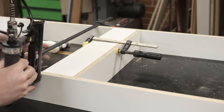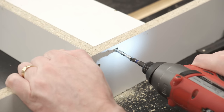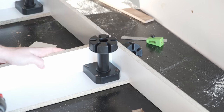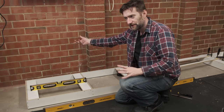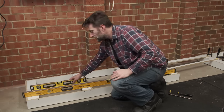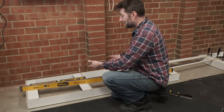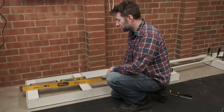The assembly process is pretty similar to the cabinets themselves - tack it together with nails, then screw together. There's the outside box, and on the inside these L pieces are made up of two stretchers to provide strength and rigidity. These L pieces also provide a space for the feet to attach to. These plastic cabinet feet provide plenty of weight bearing and adjustability for leveling - they're also pretty cheap. Leveling the cabinets is where the plinths really shine. Rather than having four feet on each individual cabinet and having to reach underneath to adjust them, I can just level the plinth and that does three cabinets at once. Really easy to access because I can just get my hand in and adjust from on top. Took about five minutes to do both plinths.